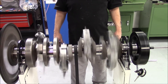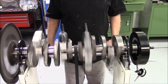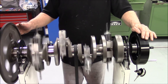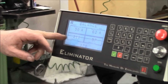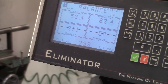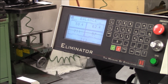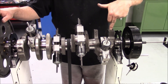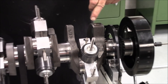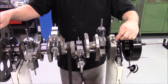What this is going to tell us is what our next move is going to be. What we have is this 211 — we're going to spin this crank over until this says 211. That means the weight wants to come out right here. We don't want to take the weight out here; we want to shift it to the center of the counterweight. So to do that, we're going to weld this hole up.